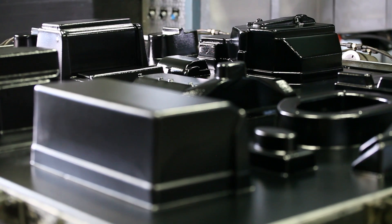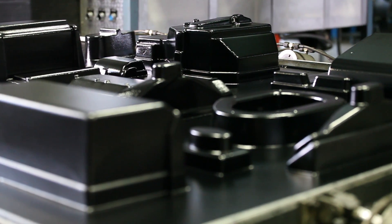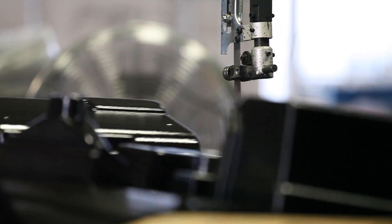As the plastic is cooled and comes from underneath the machine, the plastic is pulled up off the molds and moved into the second phase, where we separate the actual component parts from the sheet of ABS.